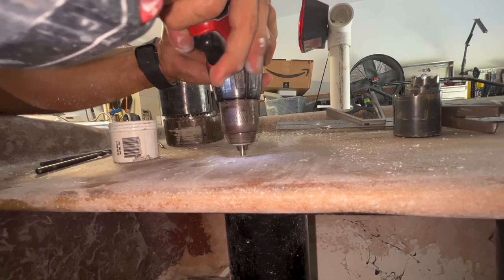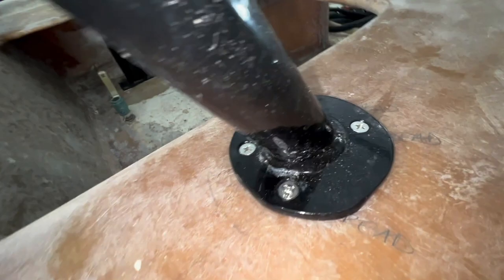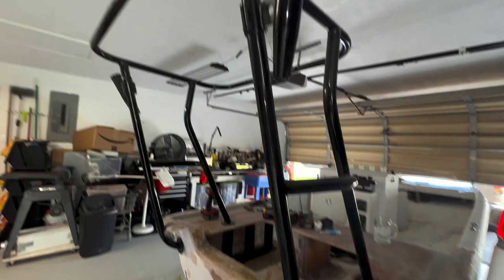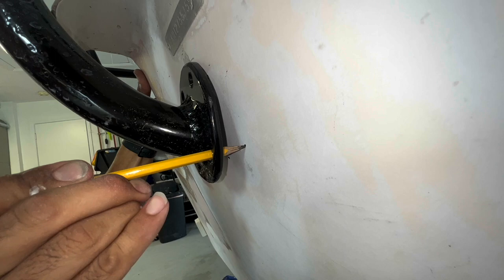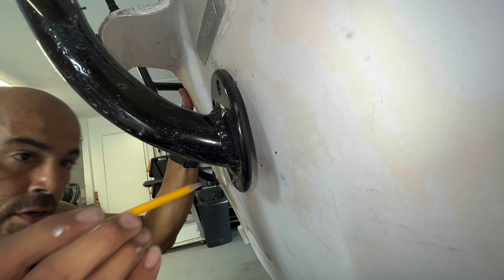Okay. We just screwed these on, these bolts. Now, Fred, what are we doing now? Now we're going to mark the holes in the back. Now that we know it's not gonna move. Okay, so this looks like a problem because it's not flush, right? Yeah, but we'll put washers behind it and then we'll just fill in. Fill it in with 5200? 5200. Wow. That's some confidence, boy. Yeah, that 5200, dude, you try to rip that off, it's gonna take part of the transom out. Really?